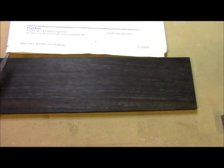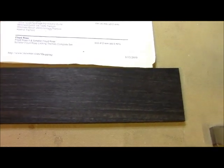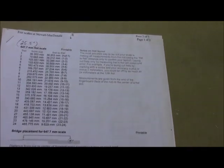We're going to pick our piece of African ebony and lay out the fret slots. We've got our piece of African ebony here for our fret board, and now that the end of the board is squared up, we're going to lay out the fret slots. We need a couple of tools for this: a pencil, a tri-square, a piece of stock, and a list of the measurements from the nut to each fret for the scale we're using.